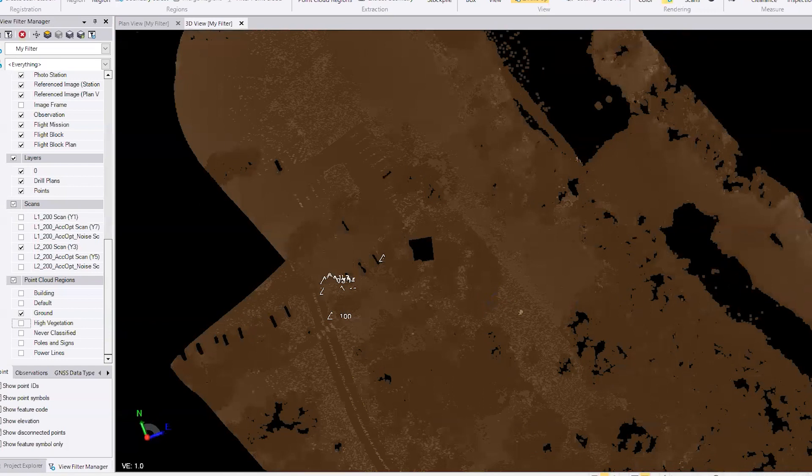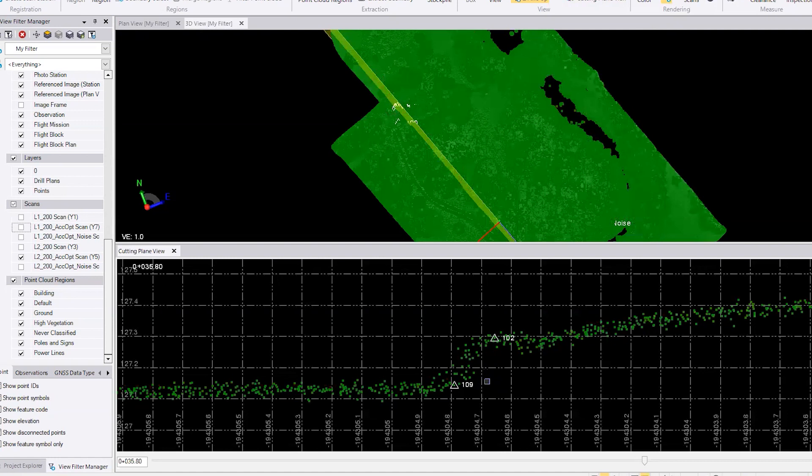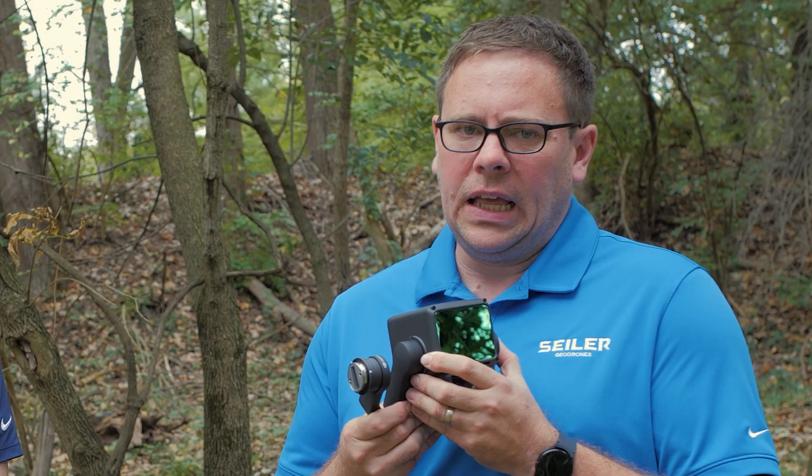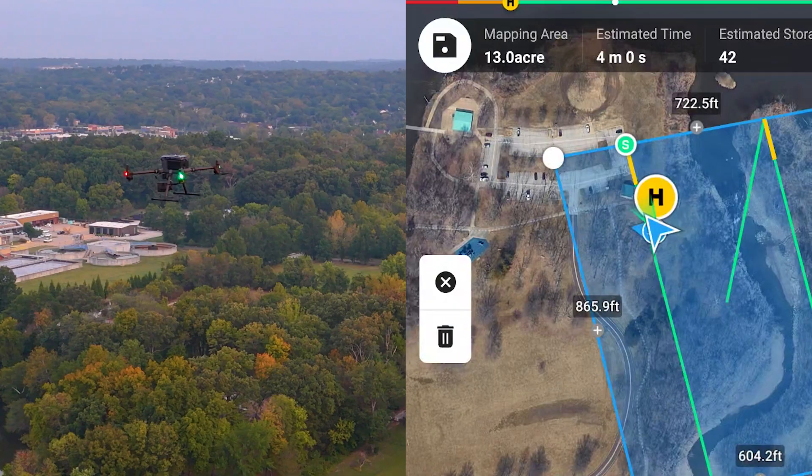For example, this is a curb here in the cutting plane view. The red is the old L1 system, which you can see is not quite as accurate and precise. The L2 definitely has some improvement there. We've also got some survey measurements — point 102 is the back top of curb and 109 is the flow line just ahead of the curb. Turning off the L1 data to get a clean look at the L2 on hard surfaces, we found we're able to measure hard surfaces much better than before. We can also get closer to the ground when flying over vegetation and actually measure what the ground looks like — improved performance in capturing reality.